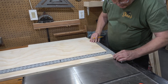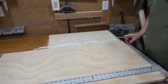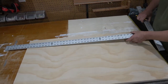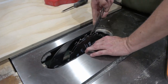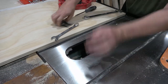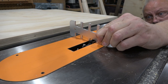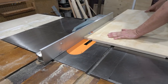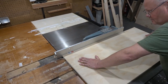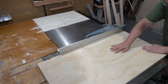Once I get the basic foundation built, I'm going to use a square and lay out some dado cuts I need to make in order to set the sides of the table in place. These will be used to actually fasten the glides to the tabletop. To make those dados I'm going to use my stacked dado head cutter, which does require me to remove my splitter from the saw. I set the depth of the dado blade down to a quarter of an inch and run the dados through the plywood. My hands look like they're in dire jeopardy here, but the dado head is set below the deck height of the table, so I'm perfectly fine.